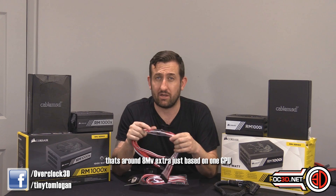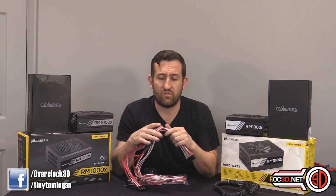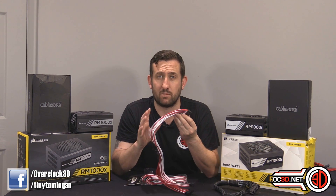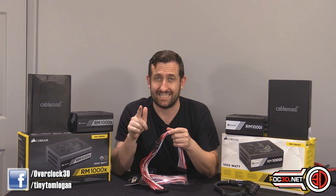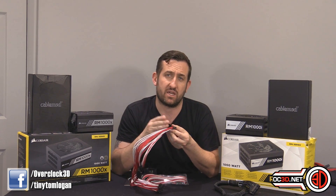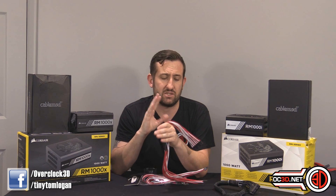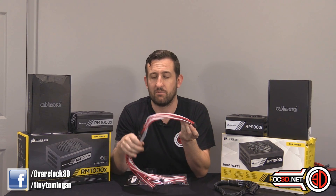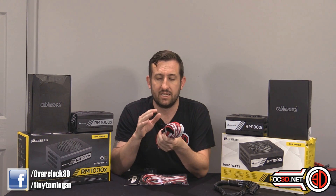The long and short of it is the capacitors are there to help with ripple. We've moved them to the best place possible for a balance of performance and aesthetics. If you wanted absolute best performance, you'd want them right at the very end of the cable. But putting them halfway down the cable gets them hidden, keeps the build looking super tidy, and you still get the very good benefits of having the capacitors there. It's just a slight relocation from where the OEM cables would have been — I think it's a perfect match.